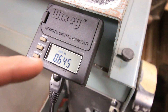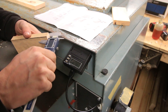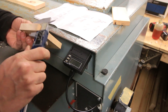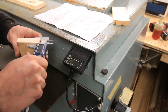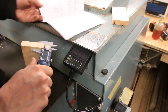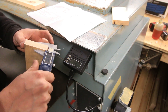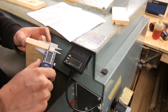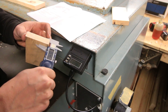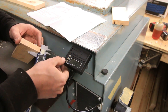I'm reading 645. Let's check this board and see what it measures. I've got 0.64. Check it on this side — 0.64. So I'm 0.005 off — five thousandths. That is well within the range that this thing is supposed to be accurate to, and I'm pretty happy with that. Five thousandths is less than a hair's thickness. I think we're good. I can press this and it'll lock it in.